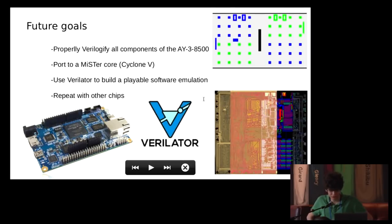My future goals are to properly Verilogify all the components, so everything works, and test them out. And Verilogify is a real word, according to the Oxford Dictionary. And then port it to the MiSTer project. MiSTer is hardware emulation. It's the DE10-Nano board by Terasic and runs on a Cyclone V FPGA. People will just plug it into their TV and play various emulated FPGA games on it.